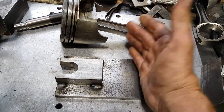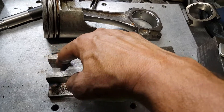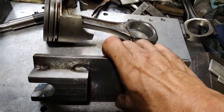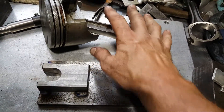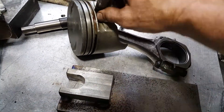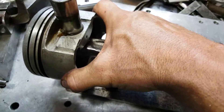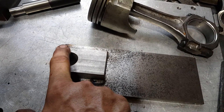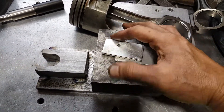The main piece of the jig is a 3/8 plate — just some scrap I had, about eight or nine inches long. I took a piece of one inch by roughly two and a half by one and a half — didn't even really measure — and machined a big U out of it. Then I welded it in two spots on each side to minimize warping, didn't go crazy on the heat. These pads hold the piston flat, and on the other side the piston resides here, not hitting the skirt on your press.